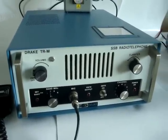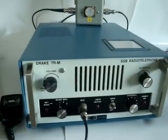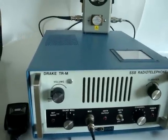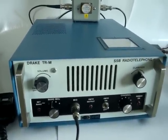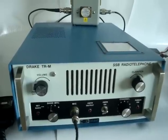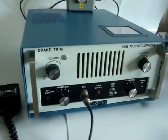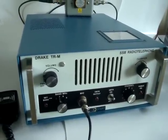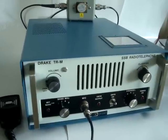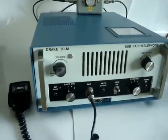That tuner can be programmed for each of the 11 channels. Each channel has its own antenna tuner capacitors and a tap point on the inductor, so you could run it directly to a wire or an open feeder. Right now I have it hooked to 50 ohms; the radio can be set internally with a jumper at 250 ohms, so you basically bypass the tuner, which is what I have done right now.